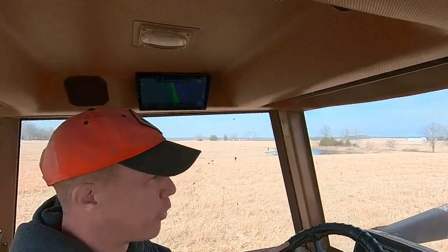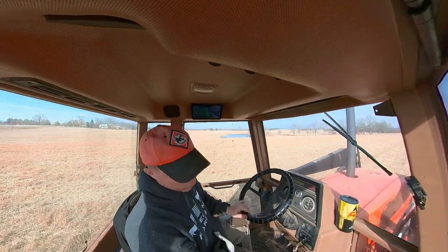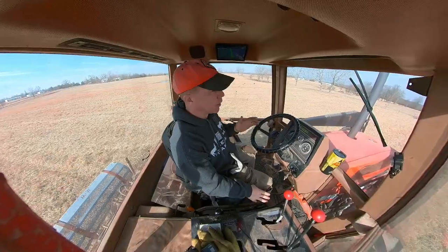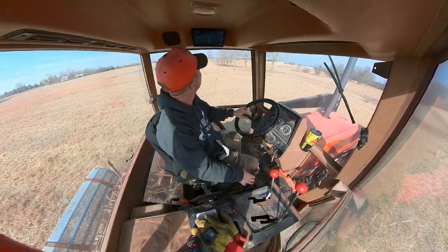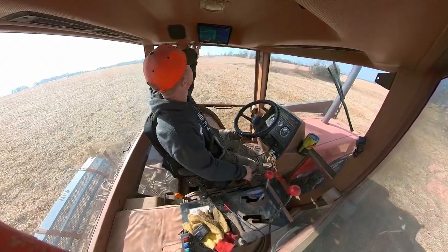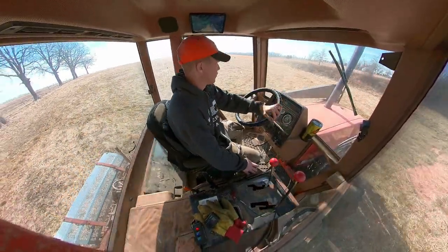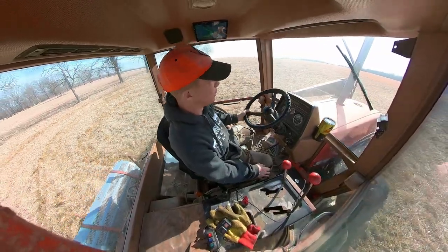Look at that. And I'm going to overlap, because I put a 15-foot implement, and that is what it is. However, I'm not as smooth as, say, a GPS-driven tractor, so I'm going to have overlap more than an inch. Very close to where it should be, and I'm looking pretty good. We're going to keep it. This bottom left corner here, it'll say your accuracy. Right now it's saying it's plus or minus 31 inches, which is almost 3 feet. That's a good size. It could be wrong up to 3 feet.